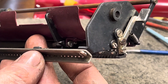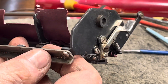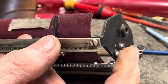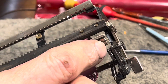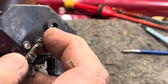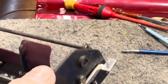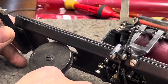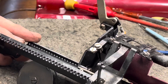Getting it out isn't that difficult because you can finagle a screwdriver in there and get it out, but to install it is a bit of a pain. So the best way I figured is to take off the carriage end caps, which is very simple - just this screw and then this screw on the back to the rail, and then this main screw. You can see there are three in a row, plus one on top for the carriage rack, and that allows you to move the whole carriage end cap out of the way.